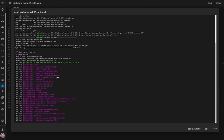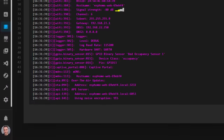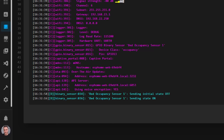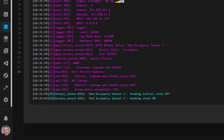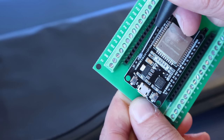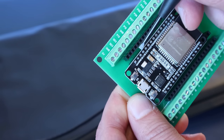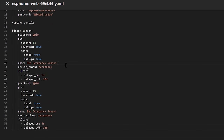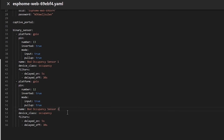With the configuration added, you can click the save button and install to wirelessly push this new configuration to the ESP device. Once you've deployed the configuration, you should see the logs page telling you that the device is online and connected. We can now press the mat down for more than 5 seconds and you should see the log update to tell you that the binary sensor has been triggered. Lift your hands off the mat for more than 30 seconds and you'll see the sensor turn off again. The ESP device should also have been added to Home Assistant at this point.